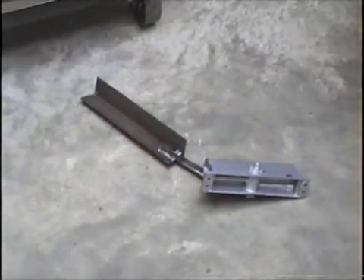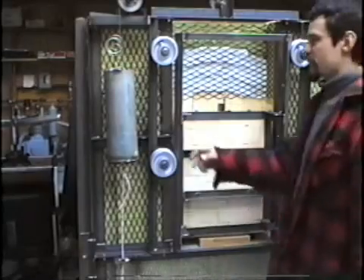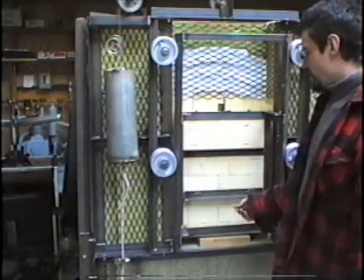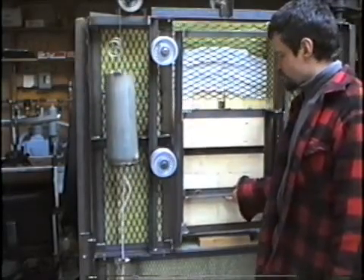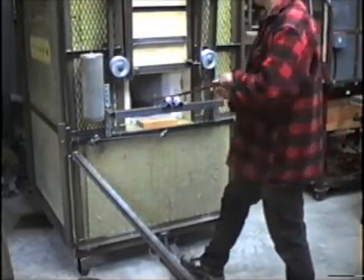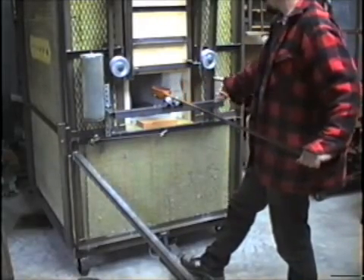That's what it winds up looking like. I've filled the counterweight cavity up with scrap lead until it's just about equal to the weight of the door, and now I can lift the door up with a couple of fingers quite easily. I'll just try it out here and make sure it's comfortable. This is a nice position — exactly where I wanted my foot to go. The rollers are in a nice place right now and I don't think I'll have to adjust it anymore.